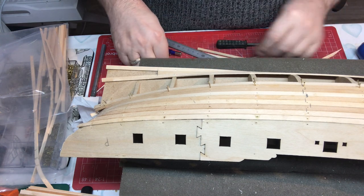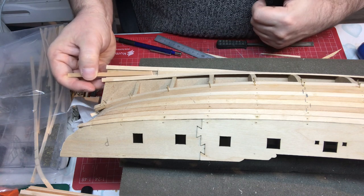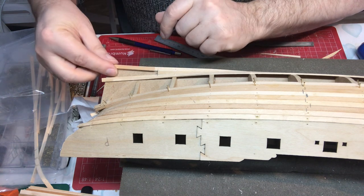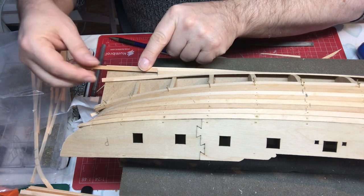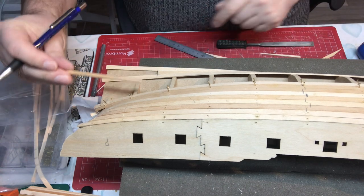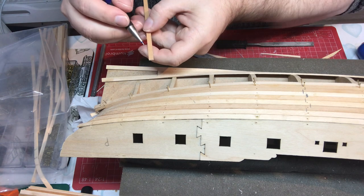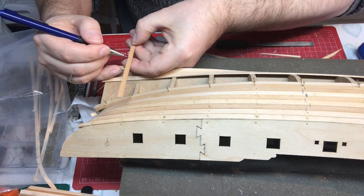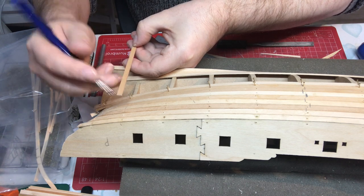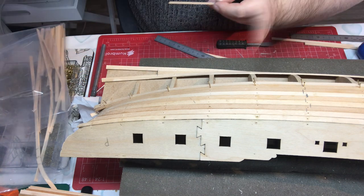So we can now take another off cut that is longer, and use this nice flat edge to mark out how long it needs to be. So we've marked that up. I'm going to measure up 2.5 millimeters on this end, and we'll cut the strip from that point to our 2.5 millimeter measured point and create a little wedge so we can place that one in the top.